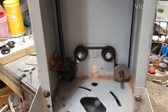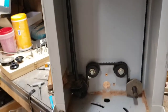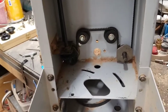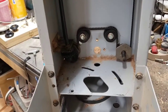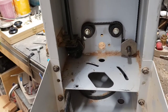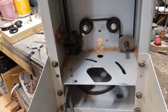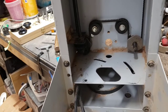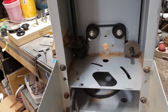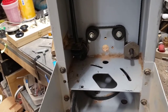What we have here is a Delta 31-255X drum sander. It is the worst thing I have in my shop at the moment because I sold all of my Ryobi tools. Since the day I got this thing — I did get it used — it has had a click or a jolt every time you turn the belt, and it feels like something's slipping or getting off. After a while it'll click more and you'll know it's getting off, and then the table will be at a level and it'll clearly not be sanding the way it should.